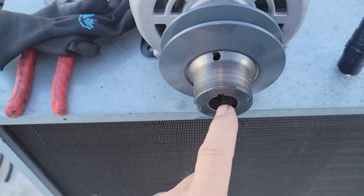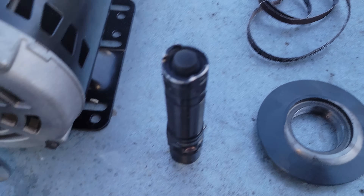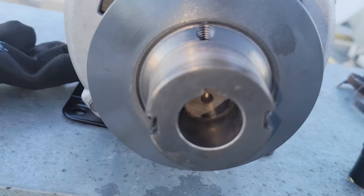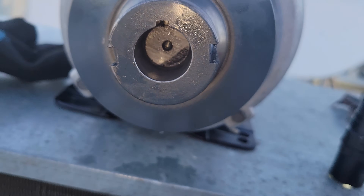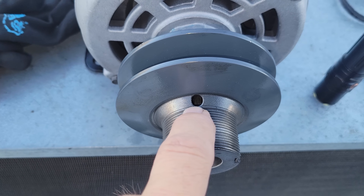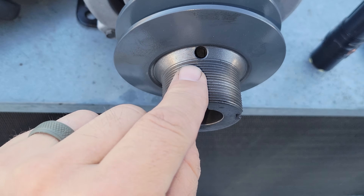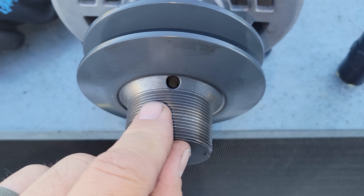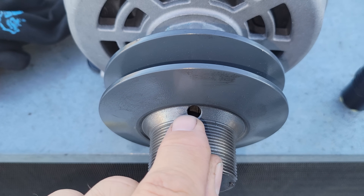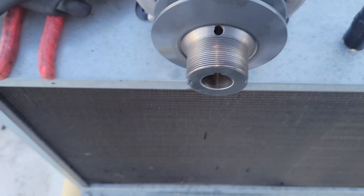It took a little work — it was kind of tight. We had to sand the shaft and sand the inside edge of the pulley, then put some penetrating oil on there. What I want to point out is there's a key in there going into the keyway. You have to make sure that the set screw goes in at an angle, so you've got to make sure the key is fully in there. I'll pull it out and you can actually see the key — if the key wasn't underneath the allen, we need to make sure it is, because that's what holds the pulley on.